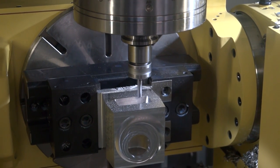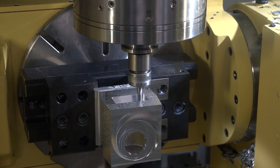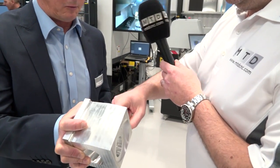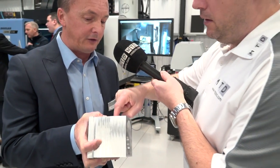Correct. If the surface finish wasn't important, even an 8mm step down can reduce cycle times up to 90%. This is exactly the type of operation where you can achieve that because you're doing it in one tool in one hit. Even this face here — if you rub your finger down that wall it's extremely good finish, and that's a 2mm step down to achieve that type of finish. With a ball nose tool, which you'd use traditionally, you'd have to step down at 0.1 of a millimeter.